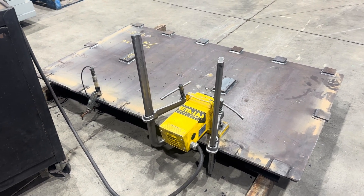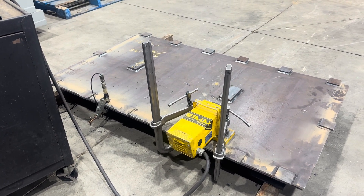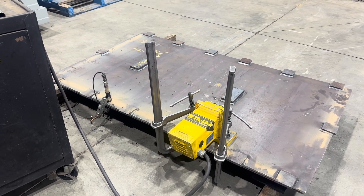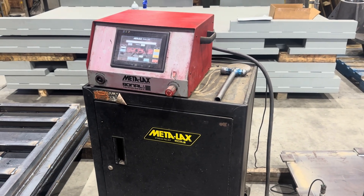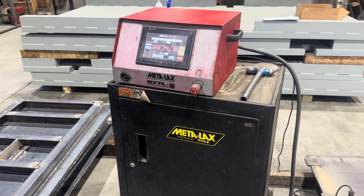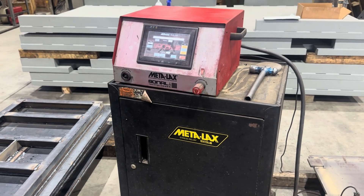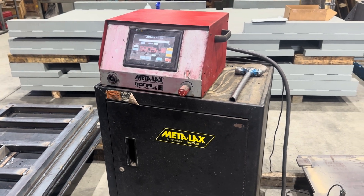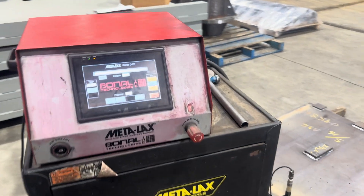There are some people that don't believe in it, and some that do — I'm one of those people. We had a job with five-inch rails, five inches by 30 by six inches thick. Before we bought this machine, they were bending and twisting after roughing. We bought this, put it into our process — rough it out, throw it on the vibe, then back onto the machine. It didn't move a thou. It was amazing. These are really cool and they work. I'm going to do a rant for you guys.